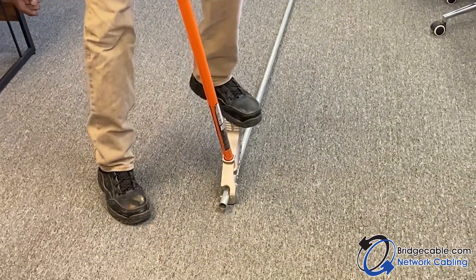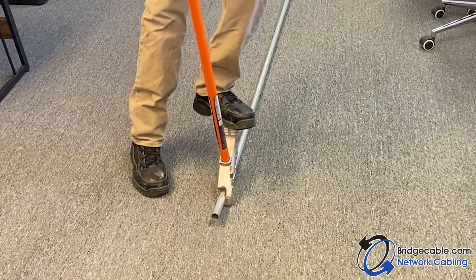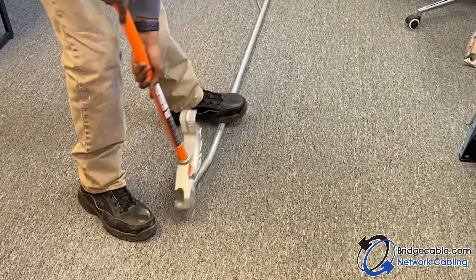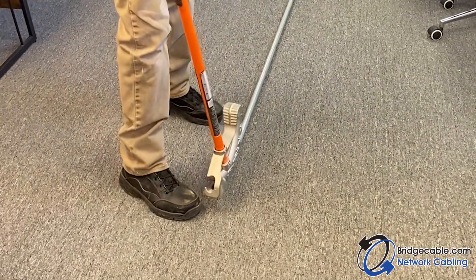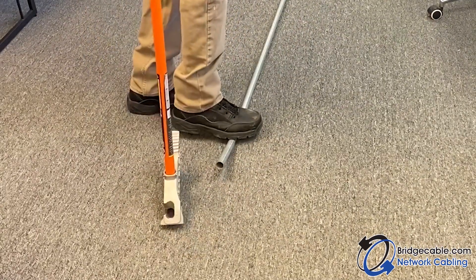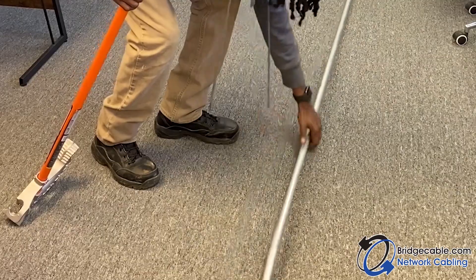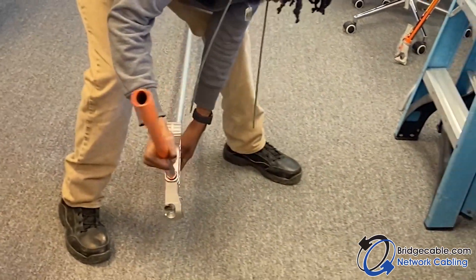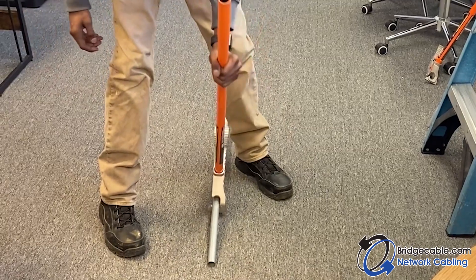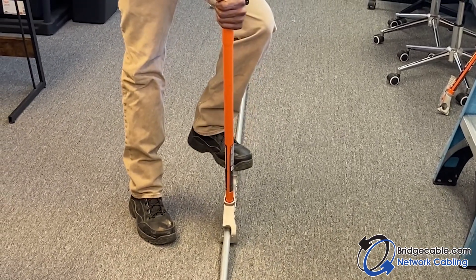You get it to a good angle for whatever you're trying to get over on the wall. Do a small one — first you do one little bend. Depending on what you're going over, it's about 10 degrees — smaller or bigger depending on what you've got. Once you have your first bend, flip it over, put the pipe back on the bender, and go under the first bend.